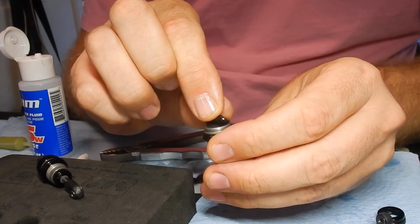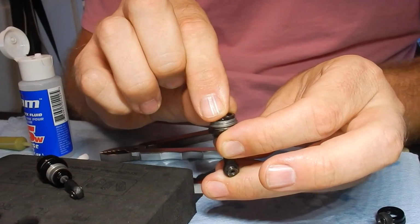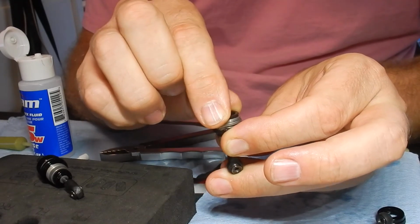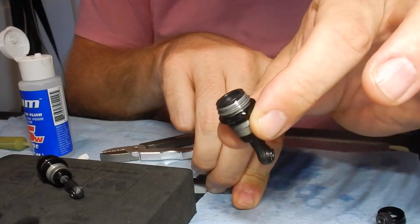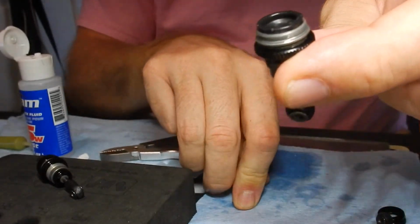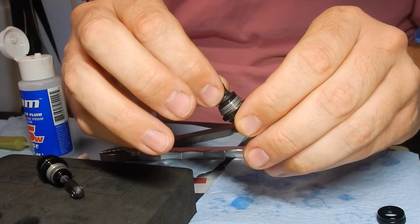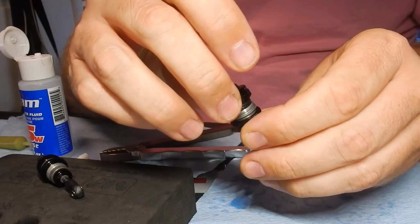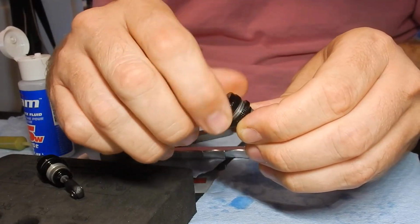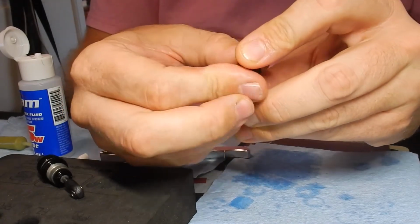I roll it back, push this all the way up till it's touching the bottom, so there's no gap, and I roll it. You see the oil squishing out, and I let it go. Roll it right down. Now it's in there. There's no gaps. It's sitting flat. No pressure on it. Take the cap, or the insert, put it on. Threaded cap. Hold the top. Tighten that up.